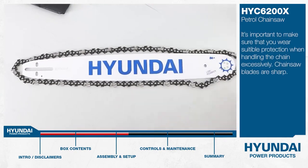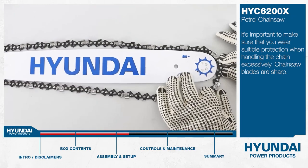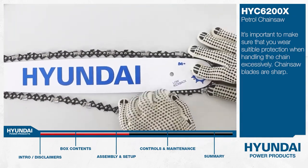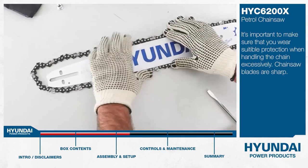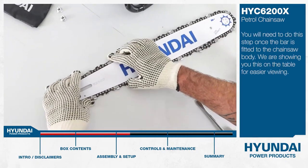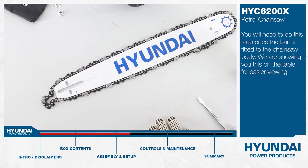Okay. So that's back the right way round, as you saw it earlier, and I can now slowly start to fit the chain into the groove around the bar. Okay, so I'll just gently work it along, making sure it goes into the groove along the way. Now a new chain can be a little bit stiff, but as you can see, that chain is now in the groove along the bar.